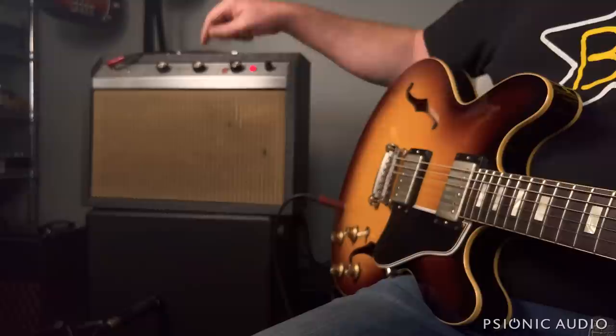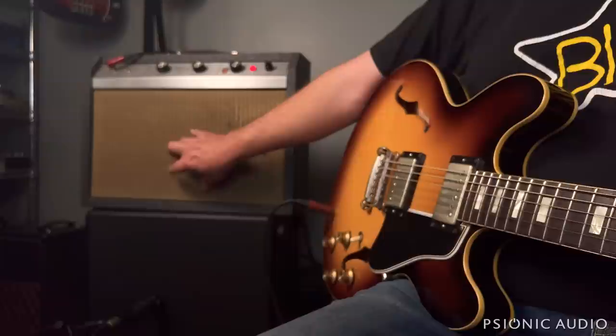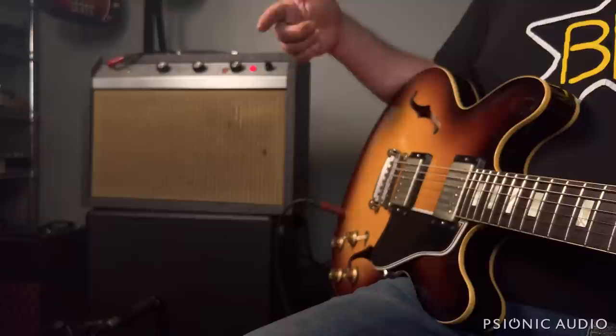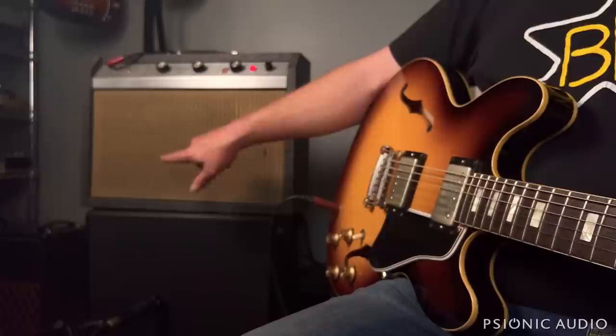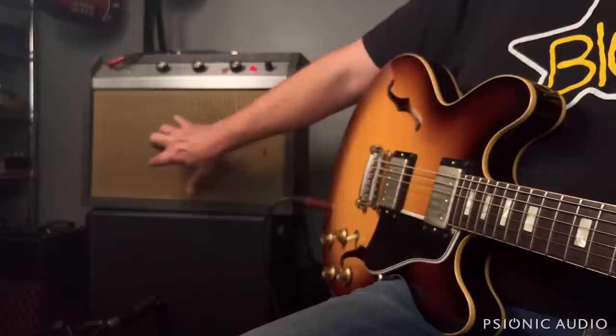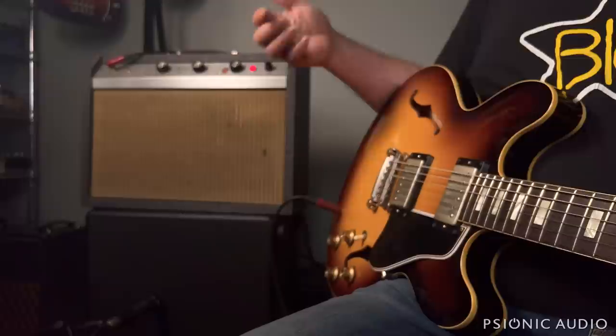The owner doesn't want any of that. But I do want the owner to know that while this speaker still produces sound, it's not just losing low end and farting out at low frequencies — it sounds to me like the voice coil is beginning to go. You can get a second opinion from Dave Halford over at Halford Loudspeakers. The danger with continuing to use that old worn-out speaker is it could die at any moment, and when it dies, this would have no load — you could damage the amp, lose an output transformer, et cetera. I would suggest talking to me or Dave Halford about having this reconed, or finding a suitable alternative that gives you the sound you've loved without the lack of low end, the raggedness, and without the risk to your amp.